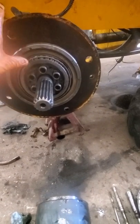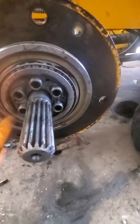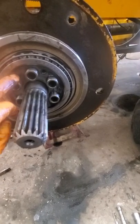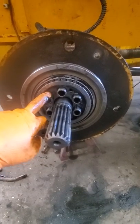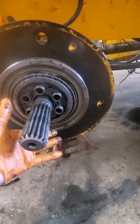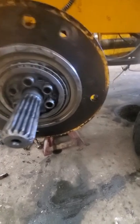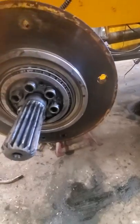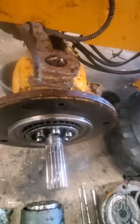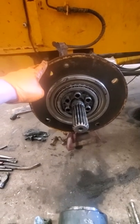Now this bearing needs to come off. You can see where I've moved it - not far, not even a quarter inch. This bearing's coming off that stationary axle stub. You should have a big puller on here to do this properly, probably pushing on here and pulling on this outer flange. I've just been wedging in behind here to pop that out. But anyways, that's how you remove that setup.